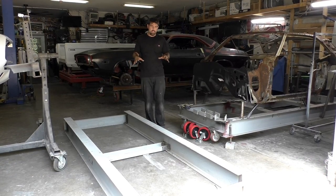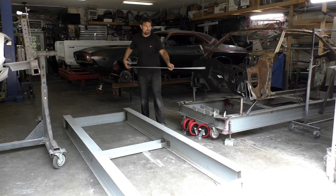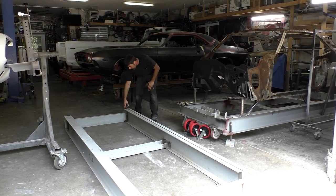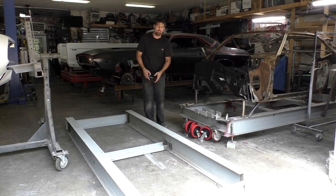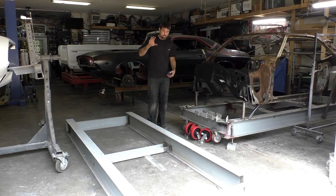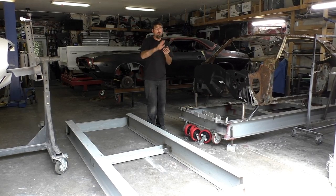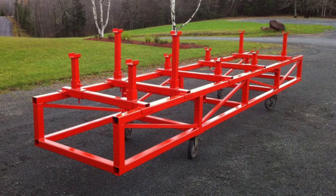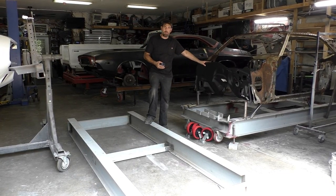What I initially did was pretty straightforward. I basically have two 10-foot I-beams, 121 inches each. For your frame jigs, you could do them out of I-beams, or you could do them out of square tube with a triangle piece in the middle - I've seen frame jigs like that. There are different styles of frame jigs and they all work. The idea is you want a good solid base that's not going to bend or move when you put a car on it.